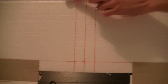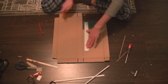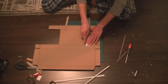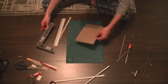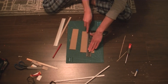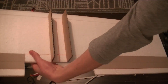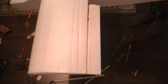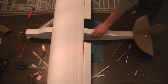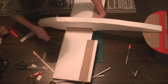I wanted the plane to have a detachable wing for storage. The wing was one meter long and the body just under that, so it's quite large. To do that I stuck some pieces of cardboard to the wing which acted like a sort of rail. This rail fitted over the body, and then with some skewers I created removable pins which lock the wing to the body.